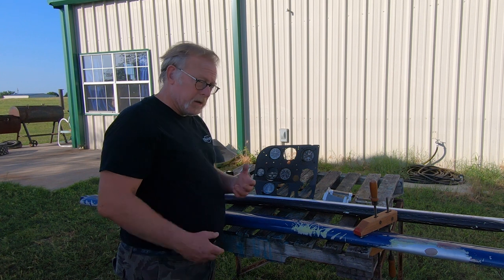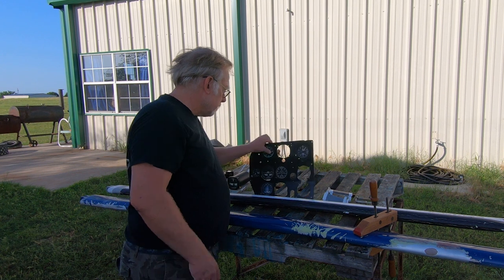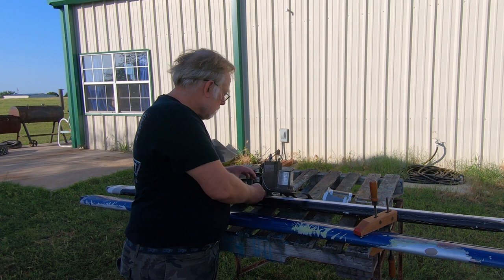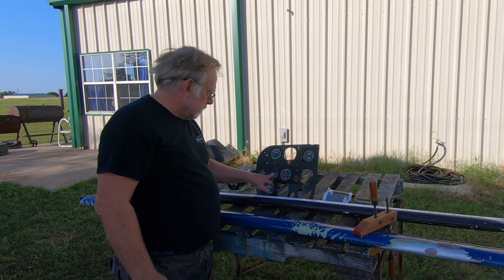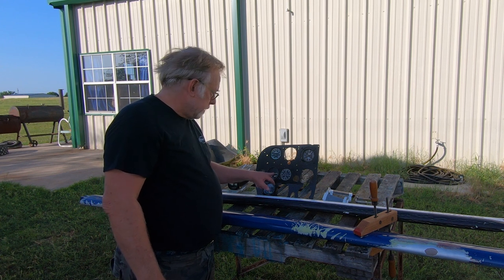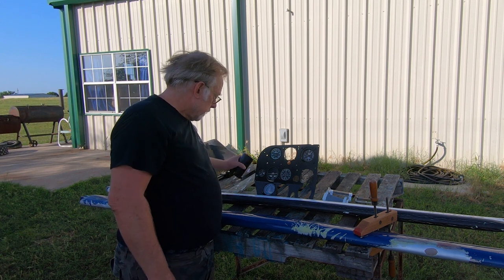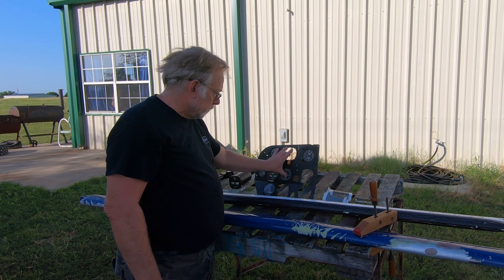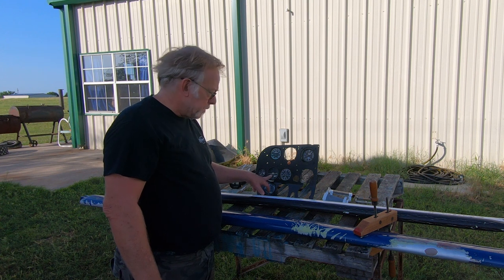So what we're going to do is we want to get rid of the vacuum system altogether. So we're going to get rid of our vacuum DG. See, this is vacuum here, our vacuum DG, our turn coordinator. This is a later installation turn coordinator. That's electric, and we're going to keep that. We also have a backup electric turn and bank, in case this doesn't work. We're going to have to send them out and make sure they're okay. So these two gauges will end up going away. We'll end up keeping the VSI, vertical speed indicator, altimeter, airspeed, and then again the turn coordinator. This will be electric on ship's power.